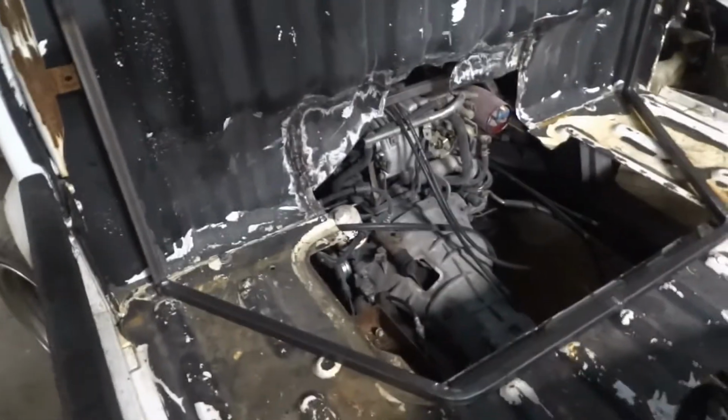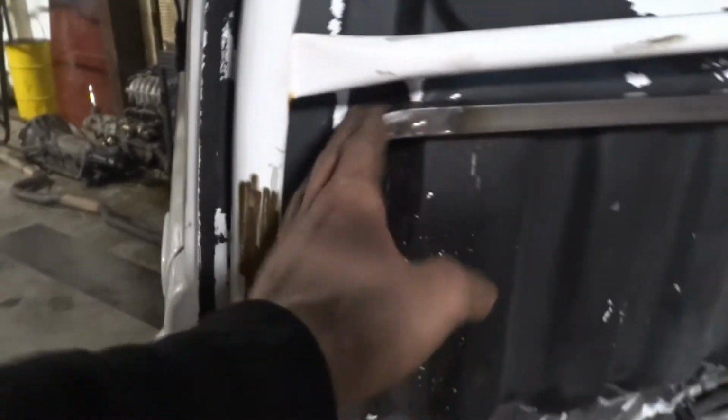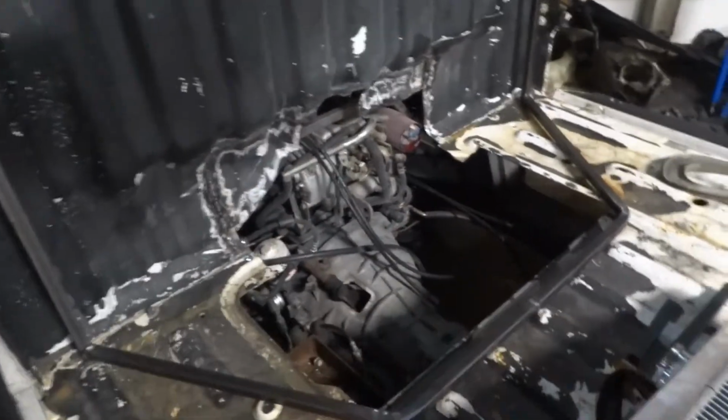Alright, so me and Kobe got a frame made for the rear mount radiator, bed mount. But I ran out of square tubing, so it's about as far as we got. And we showed you how we kind of manually bent these. Still got a little dent there, but we're going to cover this all with aluminum. And like I said, everybody's saying it's going to overheat because it's a bed mount radiator and you're sucking all the hot air from right there over the radiator.